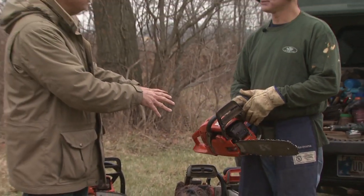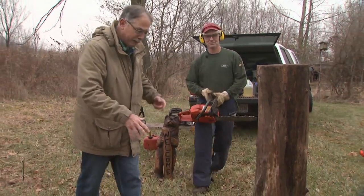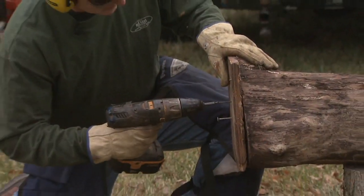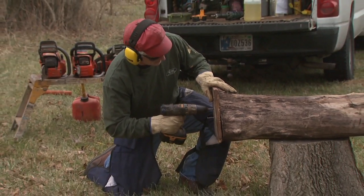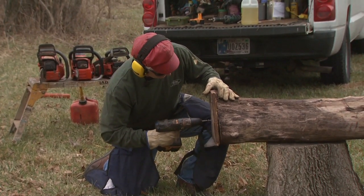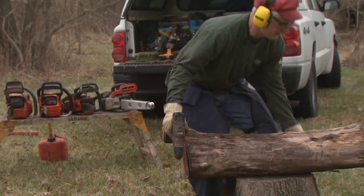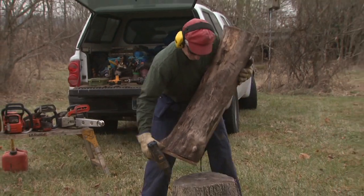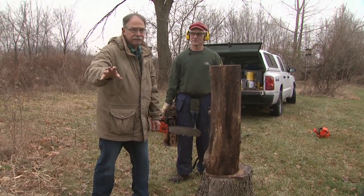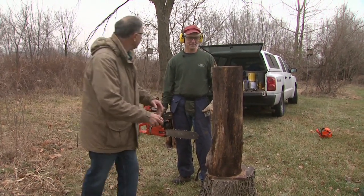Those are your primary tools. We'll get it shaped into form. Dale, come up here and tell us how you dog your workpiece down. On solid walnut, I attached a small piece of plywood to the base with two screws, then added two more screws into the base to stabilize it. There's nothing worse than trying to hold it with your foot or hand while sawing with the other. You've got to be careful of kickback — so watch his technique. Full safety gear today.